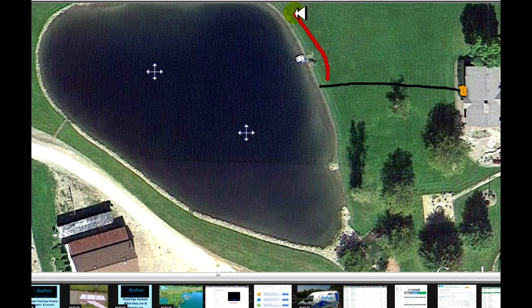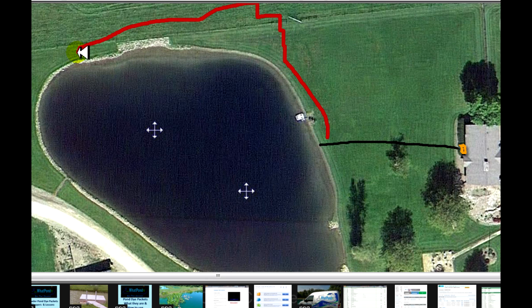Whether you walk around the outside or jump in a boat, you can run your ropes across and locate the diffuser anywhere you want. If you start pulling and it's coming off too far, walk in the opposite direction to draw it into the right spot. Going left or right outside of the pond will help drive your diffuser plate into position.